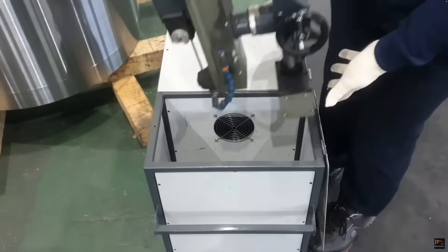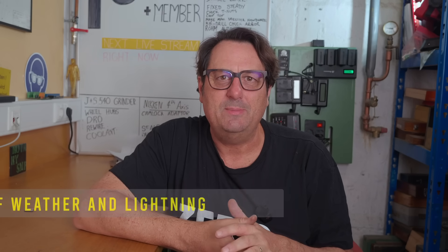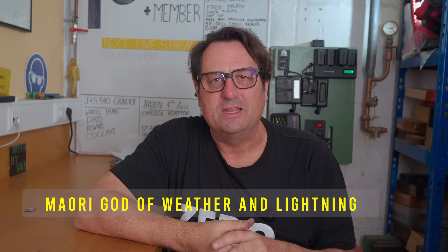If you're lucky you didn't tap it in too deep and you can just work it out — massage it out with maybe long nose pliers or punch it around and get it out that way. Of course if you're on the high end you can use one of those portable electric discharge machining setups and just spark erode the tap away to nothing. But what do you do if you break off the tap so deep into the part that you can't unscrew it and you're not blessed by the gods — so you're kind of looking at scrap.